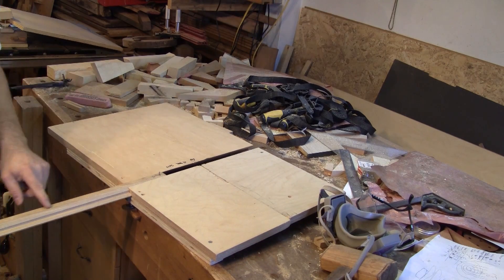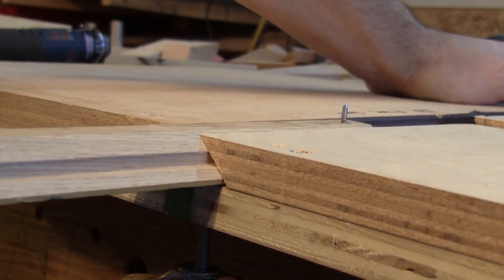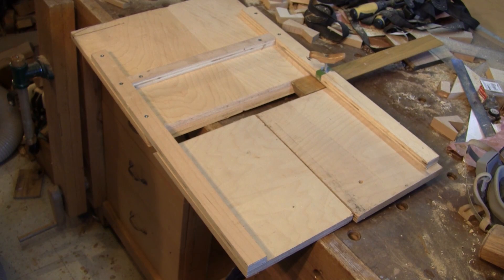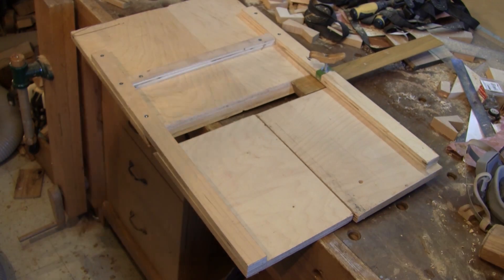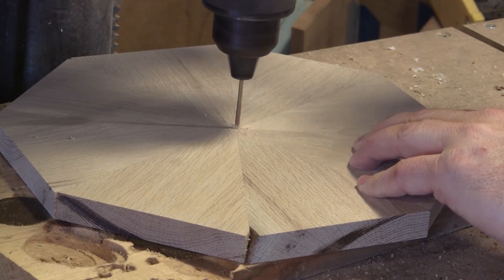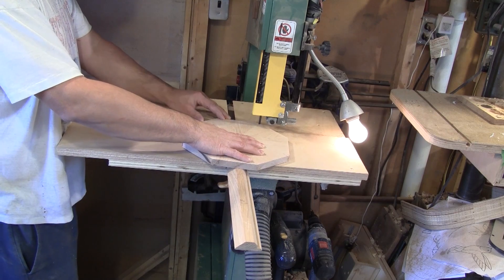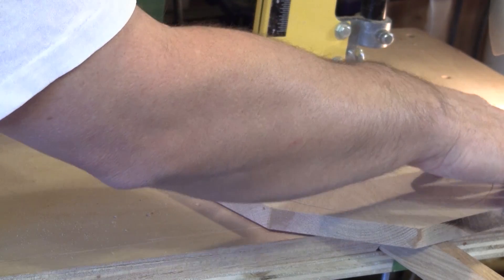It's a simple task with this jig — just a cut-off nail on a wedge-shaped movable arm that sets the circle radius. The arm is locked with a knob under the sled. The underside is simply two cleats screwed at the width of my bandsaw table top, with the last one on the backstop of the sled just in front of the blade. Cutting a circle is just a matter of drilling a hole in the center, the size of the jig's nail, putting this hole over the nail, pushing the sled up to the back cleat aligned with the blade, and turning the piece over the bandsaw blade.